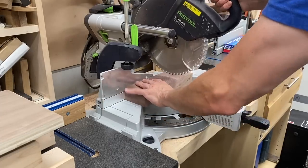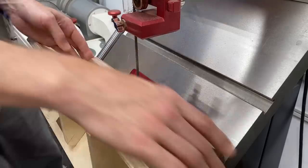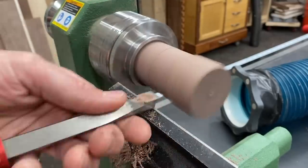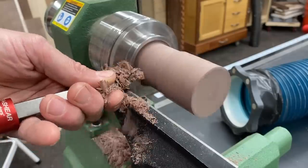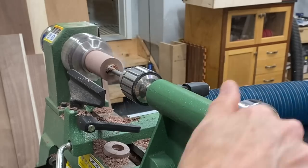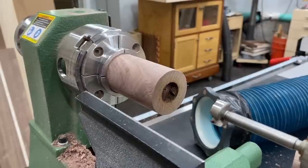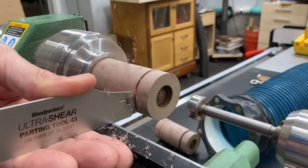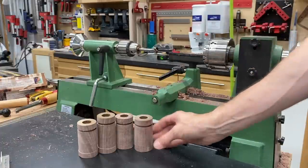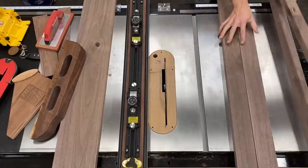In the meantime, I cut down some walnut blanks for the doorknobs on the front doors of the cabinet — I wanted to incorporate some brass powder and epoxy in those as well to coordinate with the turned posts. Back to the lathe, turned down to rough diameter, then using a Forstner bit I hollowed out a little well in the top, which will accept a nice pool of epoxy and brass powder. Then using a pencil I mapped out where I wanted my parting tool to go to hollow out a channel like on the turned posts. I made a few just in case I make some mistakes, which — oh boy — did I.